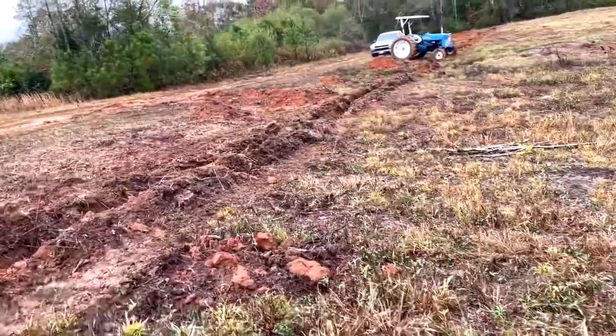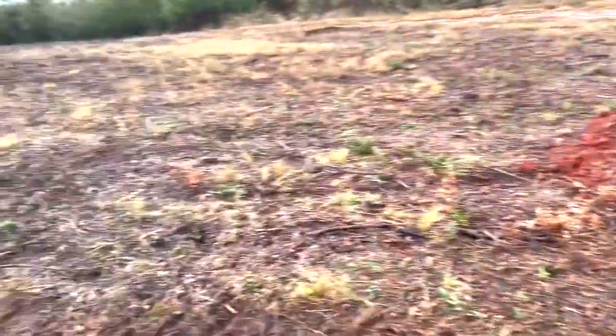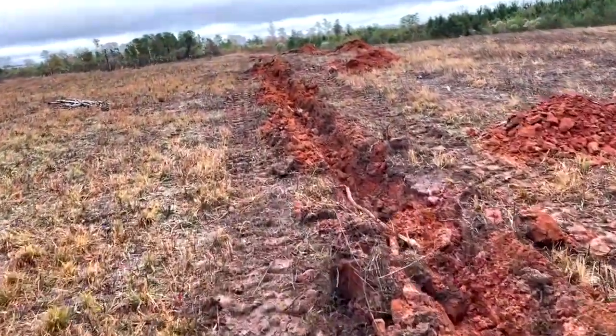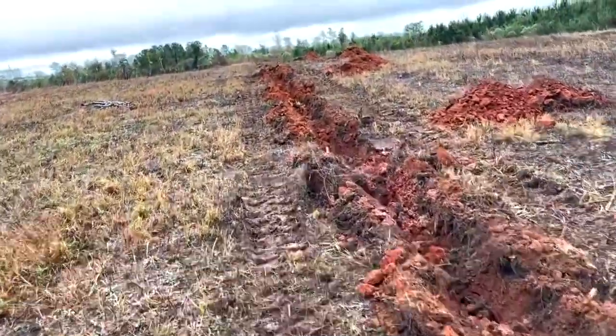First big fail: the ripper. Look, it dug a trench, but I don't think it's going to be deep enough. Actually, the idea works — it's a good idea. The problem is the land has a lot of clay in it, and that clay is incredibly hard. I'm using this old tractor and the clay is so hard it just keeps pushing the ripper back up — the ripper can't go down into the earth. If I had a few thousand pounds on top of the ripper and a 100-horsepower tractor pulling it, then maybe we could have gotten it done. But with the equipment we have, it's not working, so we had to figure out a different way. Fortunately, Brady knows somebody who has an excavator and we're going to rent it from them. I'm going to have to get an excavator to come in next week and dig it out.